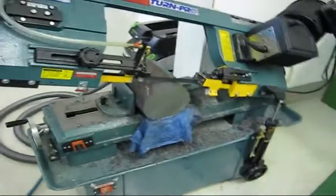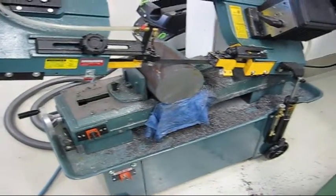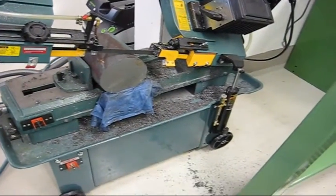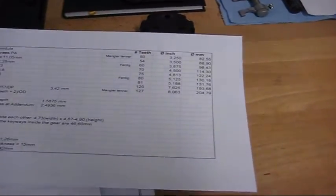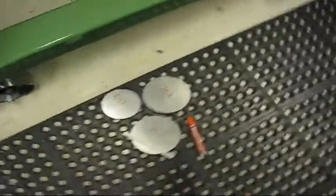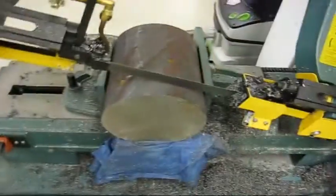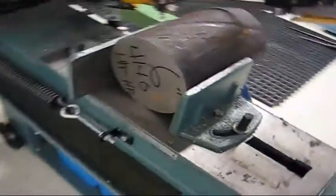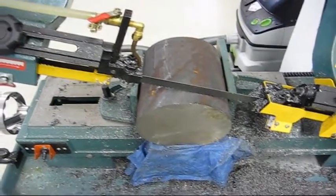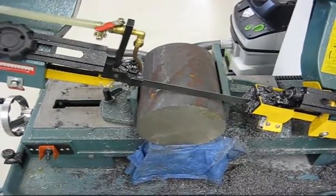The other thing I'm doing at the same time is cutting gear blanks for the metric threading on the pacemaker lathe. I already have some gears done, but I'm missing 54, 70, 75, and 81 tooth gears. I cut some blanks for 54, 70, and 75, and I'm going to cut the blank for the 81 now. It's a 6-inch piece of 4140. There's some heavy scale on it, but the other ones went okay. I bet it will take close to 20 minutes to get through that one.